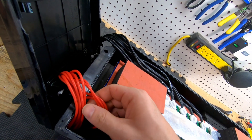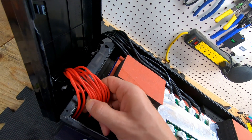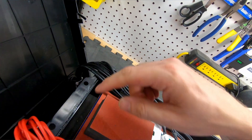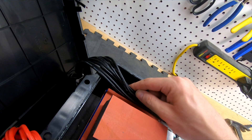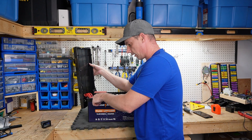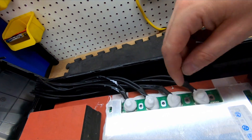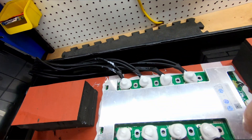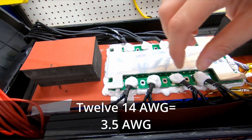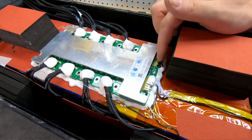On the positive side, counting the wires — there are 12 of them, though I can't clearly see their gauge. We have two 12-gauge wires per screw-in on the BMS, and then pairs of three 14-gauge wires. On the BMS we have our balance lead cables and what looks to be two temperature sensors coming out, so I'll have to test those.